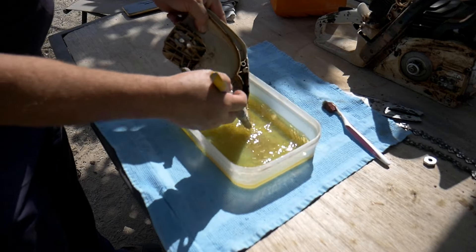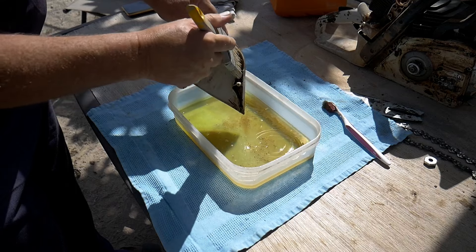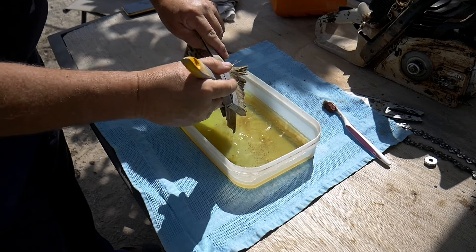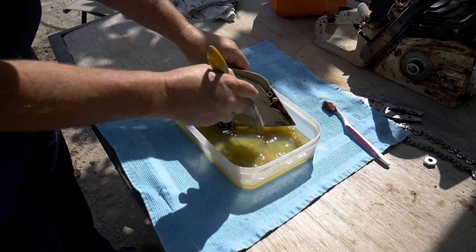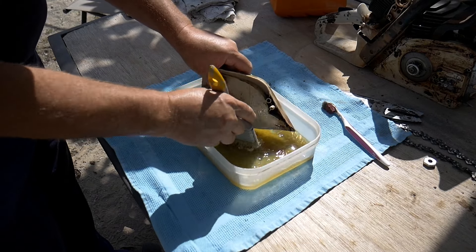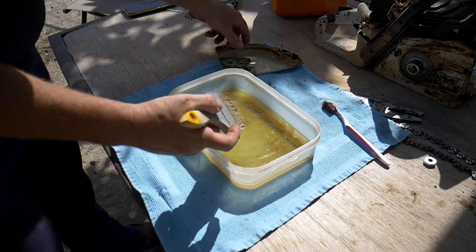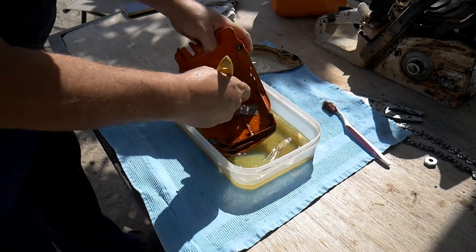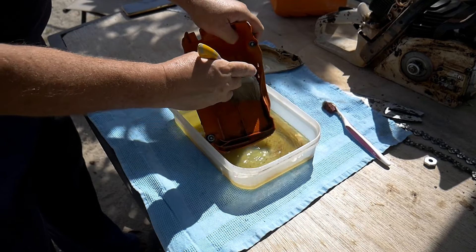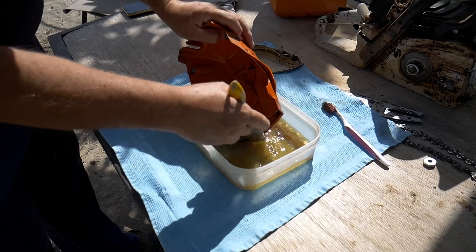What would be the difference between using diesel and petrol? Well, petrol normally dries after and that's fine. Gas oil or diesel will leave a film of oil, and obviously with a chainsaw we don't want that because that will adhere some dirt. So I will continue cleaning all this, and later I will do the machine as well and that will be done.